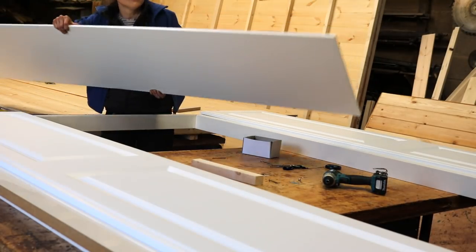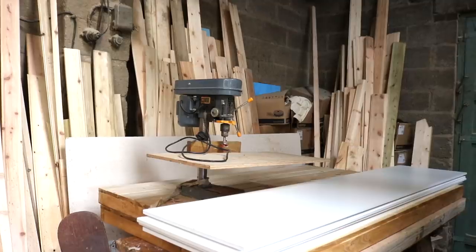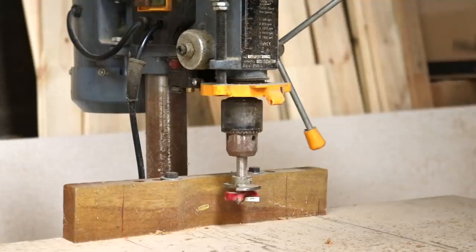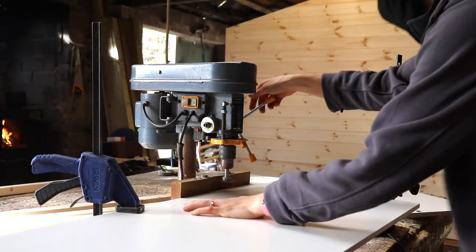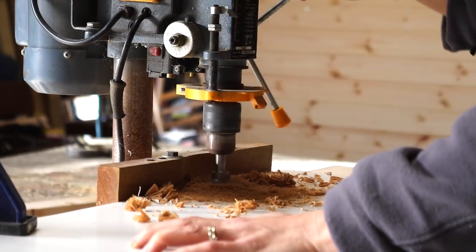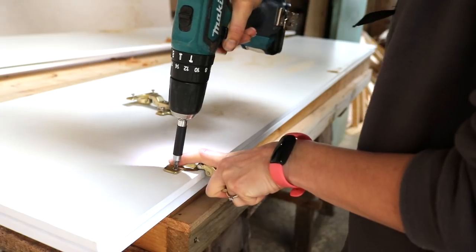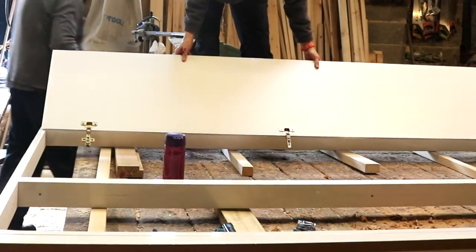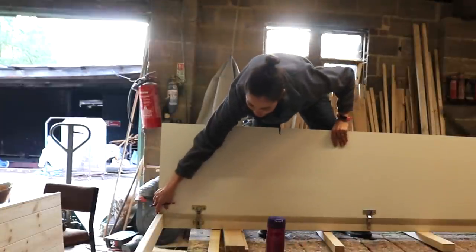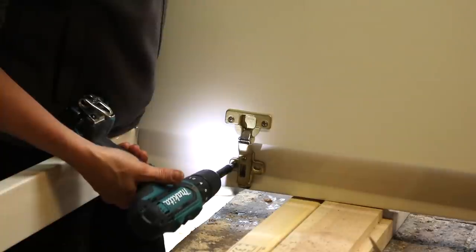Now I'm getting a visual to see how my wardrobe doors look — good enough for me. Now it's time to cut holes for the concealed hinges on the back of the doors. I'm using a drill press here with a hinge cutter and a stock piece. Just make sure when you're setting it up, do a test piece first in case you don't go straight through your good door. Next, I screwed three hinges on each one. I set the mounting plates back by three and a half centimetres, copied from a kitchen carcass I found, and as carefully as I could rested one of the doors on top, flush top and bottom, and drew where the hinge screw holes were, but made sure I drilled and screwed on the line.